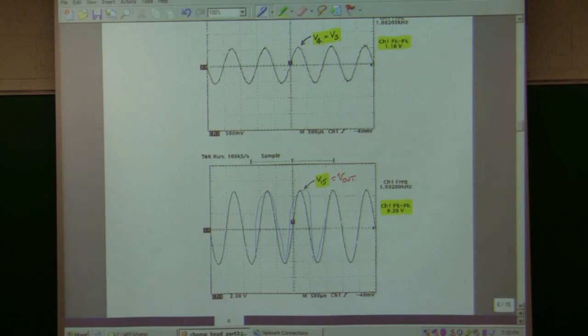So it has more content to it, and that's what sounds different than just being those odd multiples of the fundamental. Now, there are guitar pedals that are meant to just do that, chop the top and bottom of the waveform off and create these higher order harmonics. The Fuzz Face is one. And so you get this real screechy noise when you're playing a note because you're getting things out to 7 kilohertz, 9 kilohertz, 11 kilohertz that have a fairly large amplitude. It's a very screechy kind of sound.